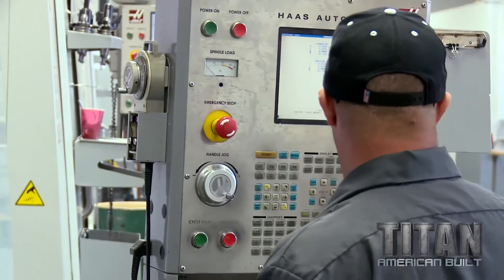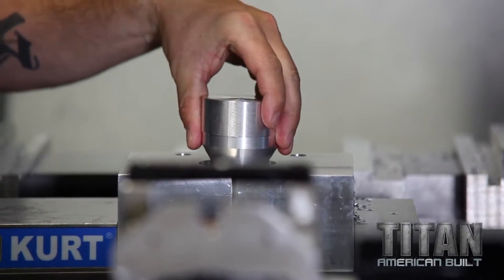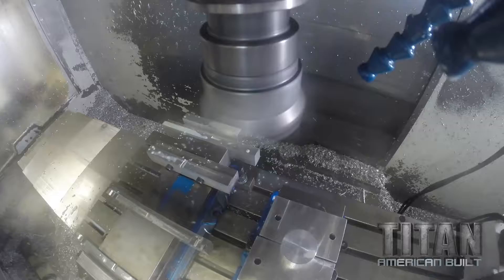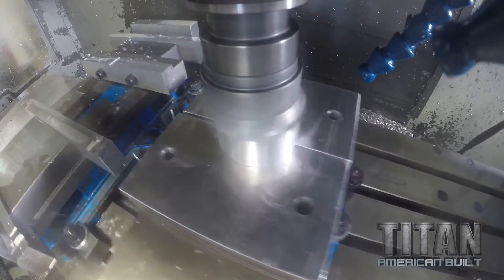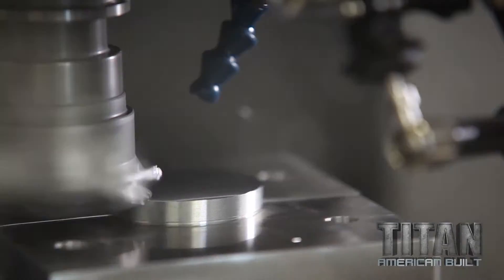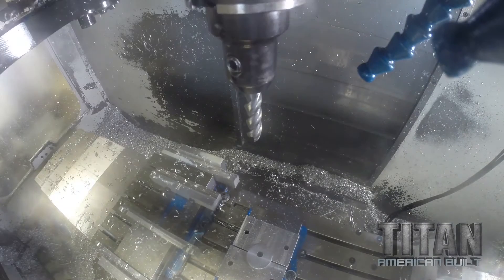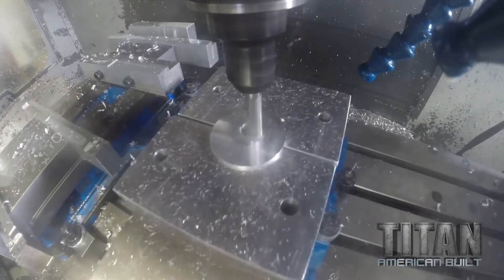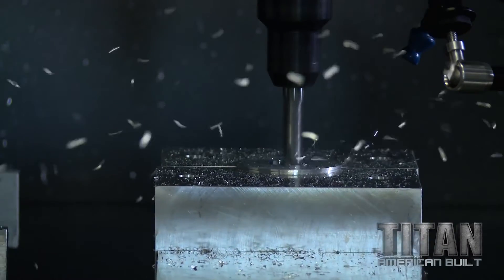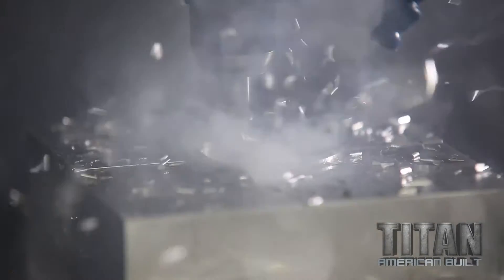This all looks good — no errors. Got my soft jaws cut. I'm going to take a three-inch face mill, cut the part to size, put a drill in there, rough it out for my half-inch end mill, make the pocket, check everything out to make sure it's dialed, and keep working on the next operation.